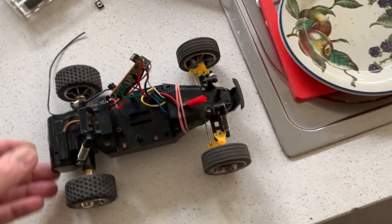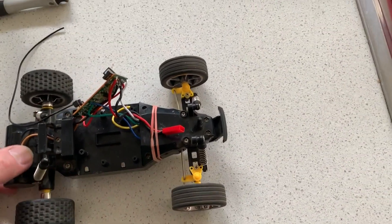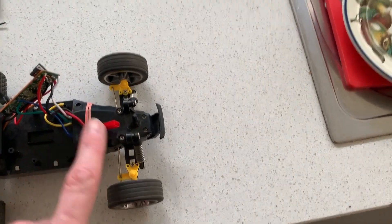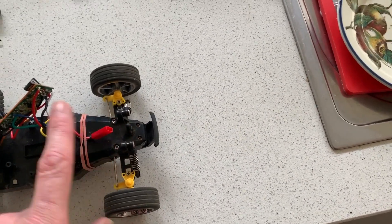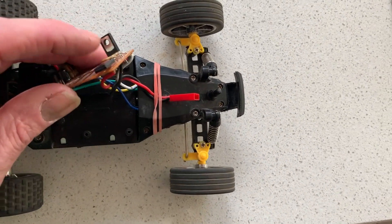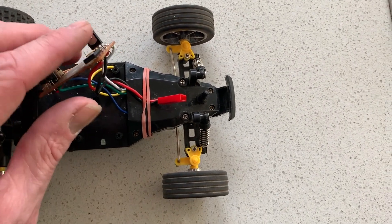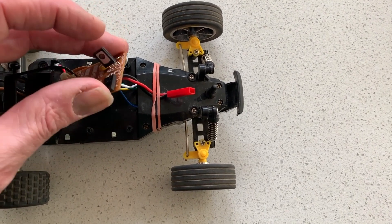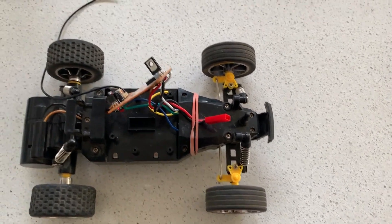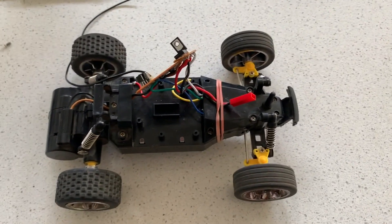This is just a little six volt — actually it runs on four and a half volts or something like that — with some double-A batteries in the bottom. But I've actually connected a lead to it so I can run a LiPo cell or a nickel-metal hydride battery of higher capacity. And if you do that, you really need to put an aluminium heatsink on these to increase the surface area, which helps them cool down. Some conducting paste and then a big piece of aluminium, which you could screw in and attach to the back side of them like a fin to help it cool down. They fly with faster batteries. So there you go, done.